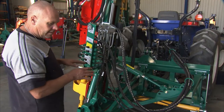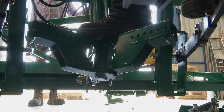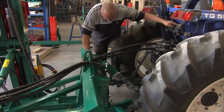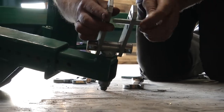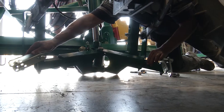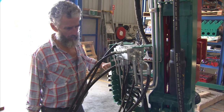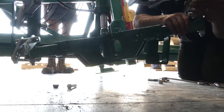We need the arms to come down — normally they'll come down by themselves. If they don't, you may need to stand on the arms and put a bit of weight on them to drop them back to the ground. We can loosen those bottom nuts enough so that this will spin freely, then install the arms into the Y-frame. By using the hammer-on function, we can pull the Y-frame up against these arms.